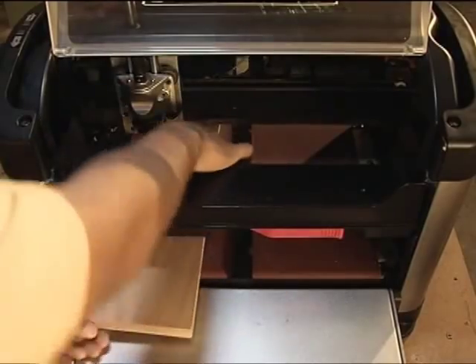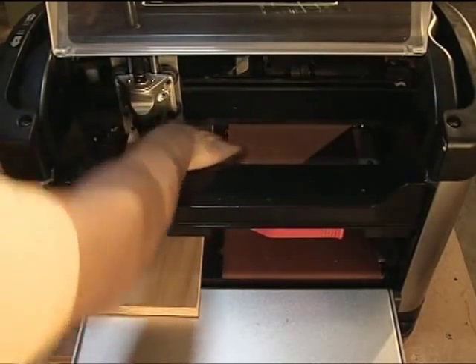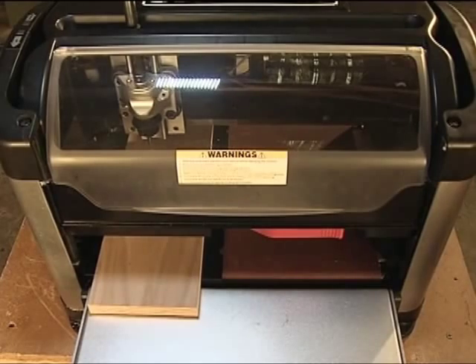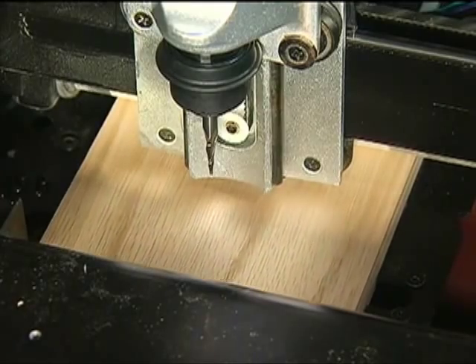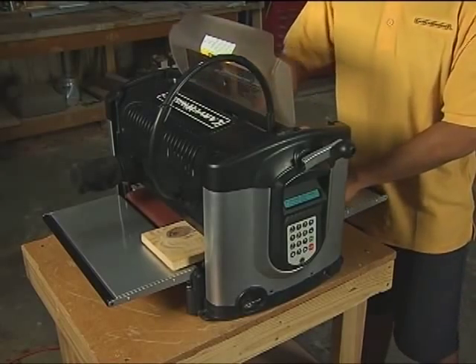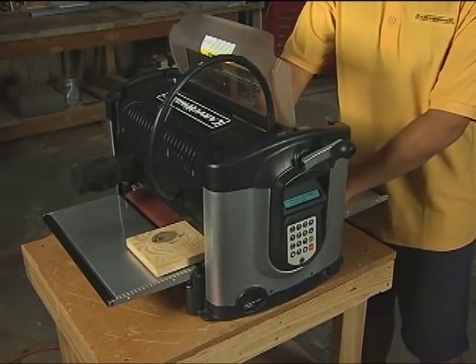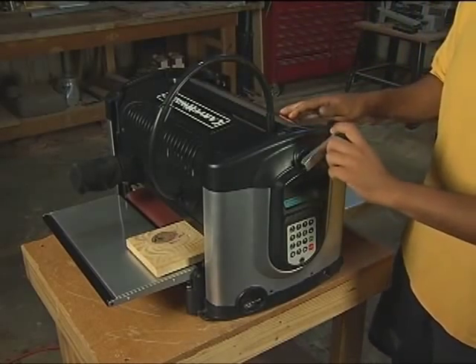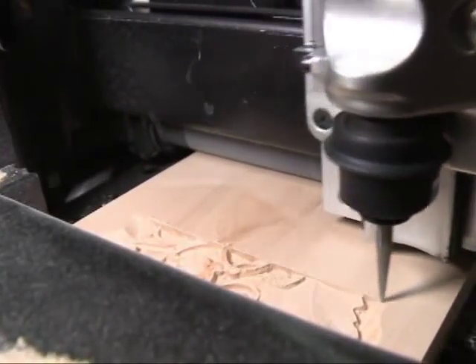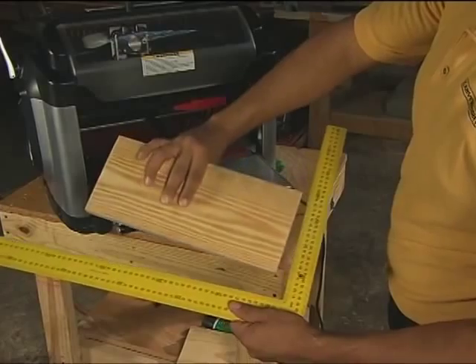In general, it is a good practice to put a board into the machine that is slightly larger than your original design, and select keep original size. Be very careful when scaling down a project at the machine. The machine will scale the entire project to the largest size that will fit the workpiece while maintaining the overall aspect ratio of height to width. It will not change the aspect ratio to fit that of the workpiece. Scaling down can also lead to undesirable thinning of the carved elements that may lead to wood chip out.